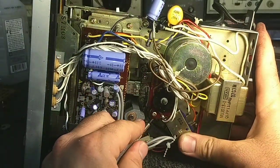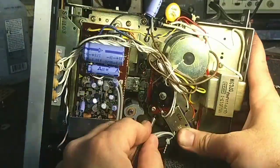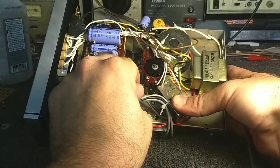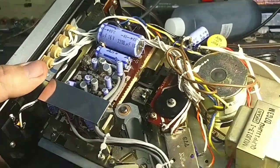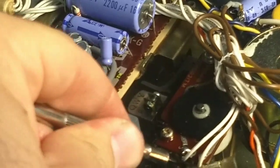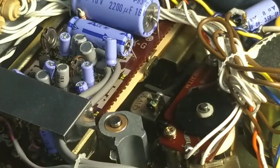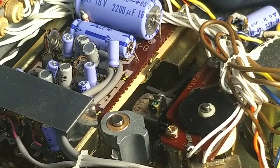And I don't know if you can tell, when I move the solenoid, you can perhaps see that the head moves up and down. I'll get a better shot of that in a little bit. I'm just going to finish cleaning this. Okay, so watch the head. This is the head. Watch as I move the solenoid. You can see it go down, come back up, etc. Because there's 8 tracks, 4 programs of 2 tracks each, stereo and all that sort of thing.